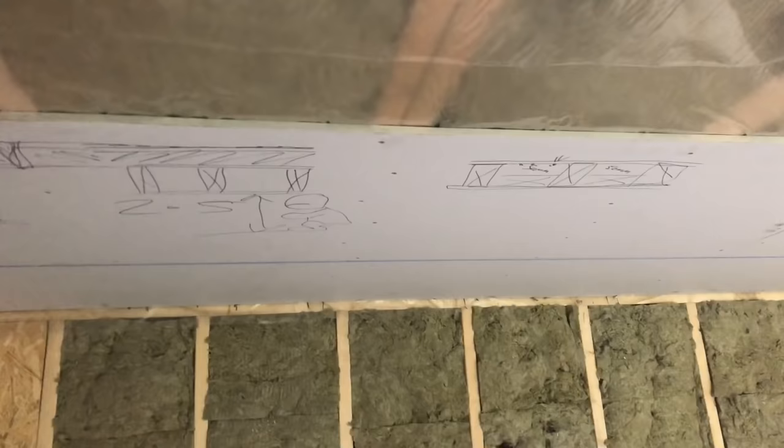So basically we've got our 50 mil foil backed in there. We've then got our, sorry, it's 60 mil foil backed. We've then got our 50 mil Rockwool sound block insulation. We've then got our moisture barrier and then our 12.5 mil plasterboard. Adam's pinged the line on there now for that row of lights. We'll drill them out and make sure they're all in the right place. What you want to do with these screws, on the double ones, we're just staggering them. But you don't have to, but the screw holes want to be at least 300 apart.